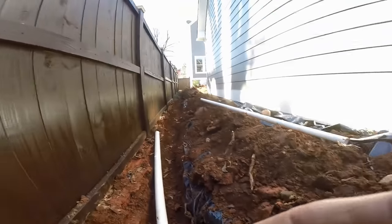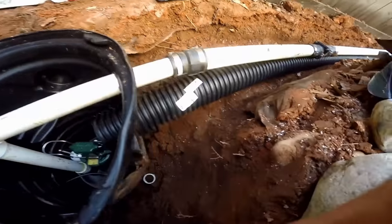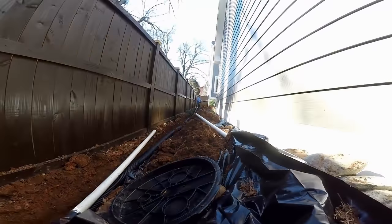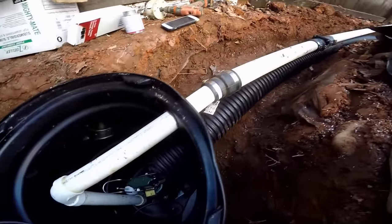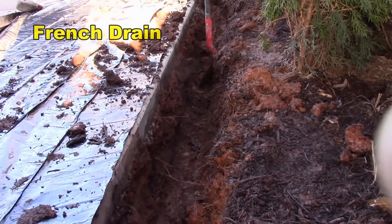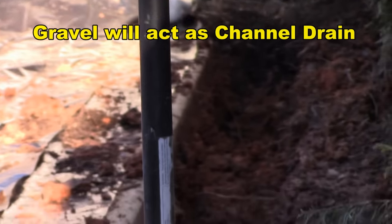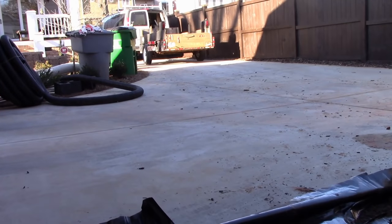All that comes down into the sump pit; the pump lifts it up and pushes it all the way out to the street. We've brought our four-inch corrugated solid pipe into the sump pit coming underneath the discharge. This line runs all the way up — there'll be a tee right there to hook up the downspouts. We're right alongside the driveway, down about 20 inches — good depth. We'll have a good base of gravel. At the end we'll put a catch basin, fill it up with gravel, and as the water comes down the driveway it should drop into our system and run over to the sump pump.